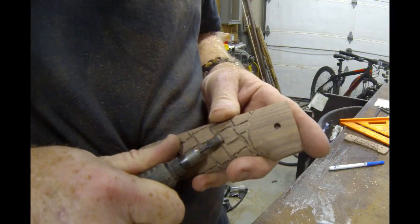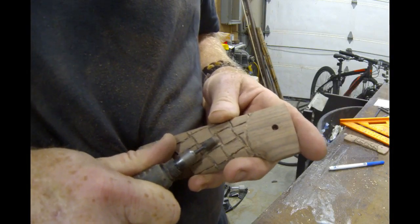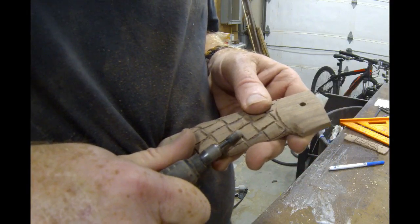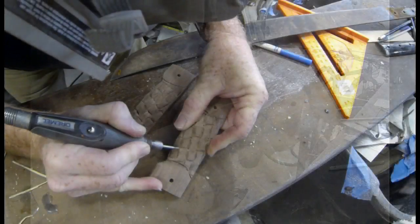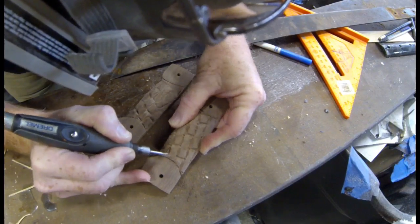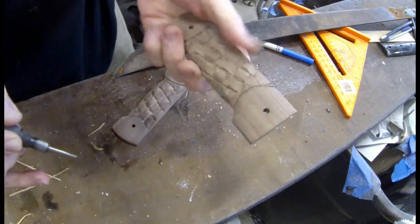That's one scale with all of those outline lines cut. The next step — I have a small drum sanding wheel, and I'm going to taper down each one of those woven pieces that has to go under the one above it. You do have to pay a little bit of attention. I curved the lines so that I know which piece to sand down, and it goes pretty quick. After I've done every single segment like that, I have a very small diamond bit, and I'm just going to clean up some of the lines and create the space at the corner of each one of those woven pieces.